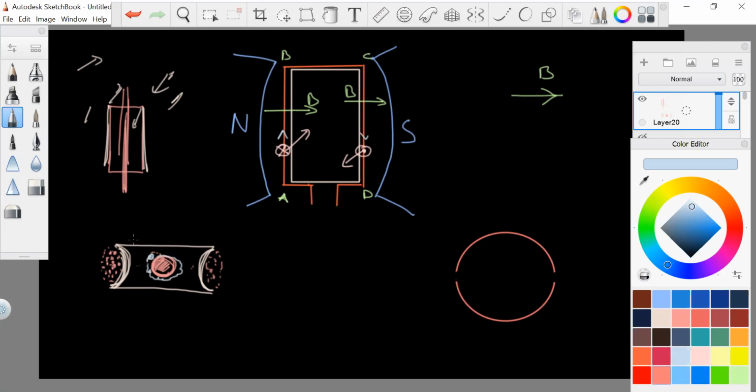Now the coiling, what you were doing: take it round like this, across this, and then bring it from here, take it from there, sometimes bring it from here and take it from there. Is that clear? The more it happens where it is balanced from all sides, you'll have a properly balanced coiling. And this will be tightly fitting on this, which I was checking. If she has done it properly, you don't have to put so much glue. The coil itself will be quite tightly fit. Is that clear?